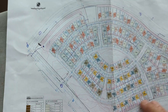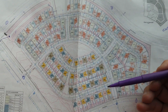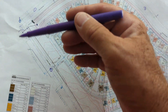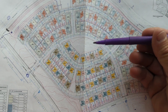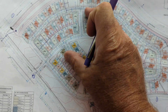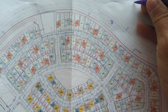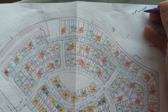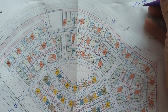We normally call the pad rebar our first generation because it's primarily for us to work off of. Over time they may reduce sidewalks, curb, and all that, and may wipe out intersections. First generation is your tightest. When it comes to second, third, and fourth generation, everything fits within the perimeter. We normally go from control points to working points. Working points are just temporary - maybe just a 60d nail to accomplish a couple things. It's just a way to code something that's temporary.